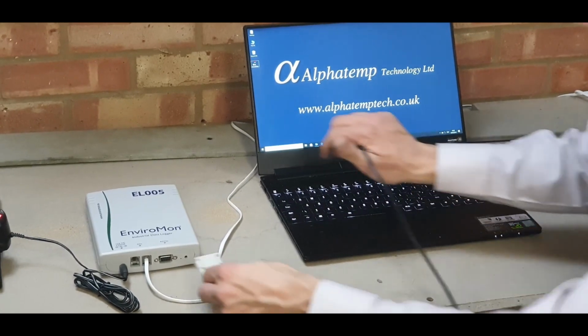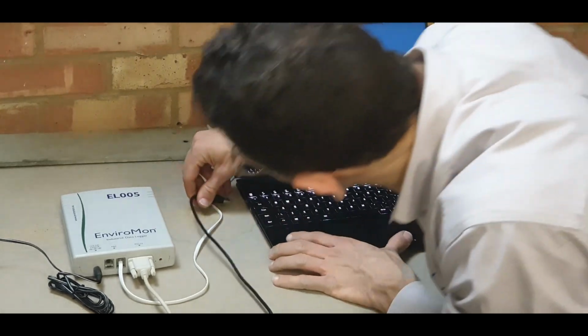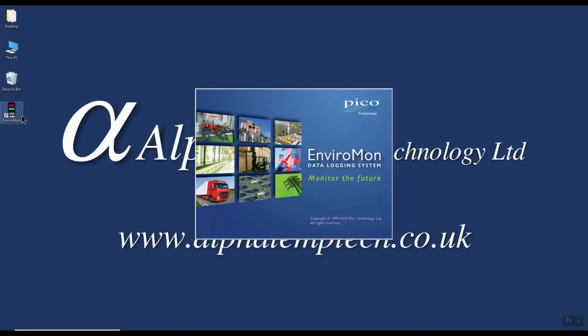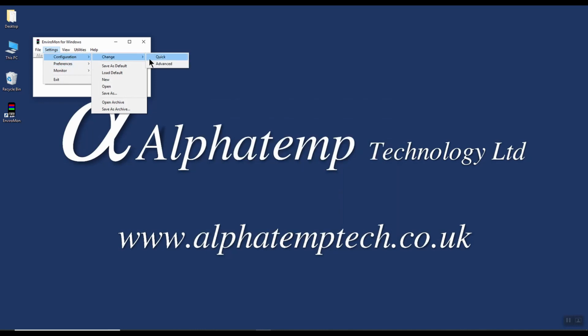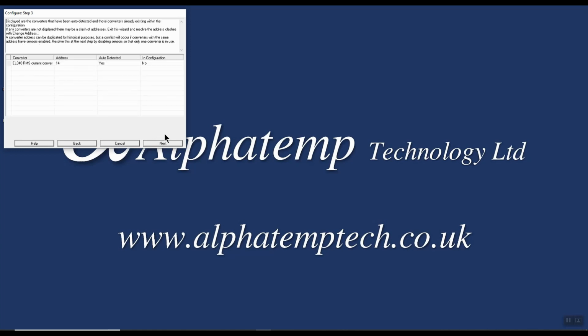We can now connect the data logger to the PC for configuration using the supplied USB to serial adapter. We can now run the software. Choose Settings, Configuration, Change and then Quick. Click on Next and then choose the COM port. In this case it's COM4. Click on Next. It'll scan the data logger to see what's connected to it, and it's found an EL040